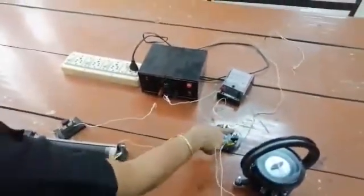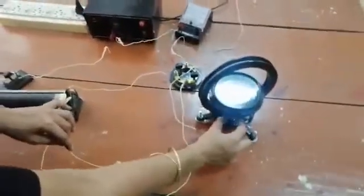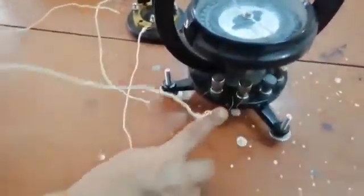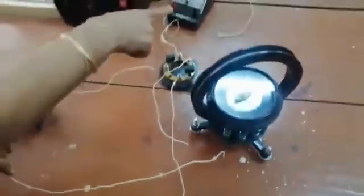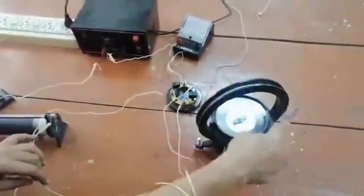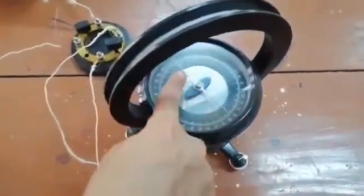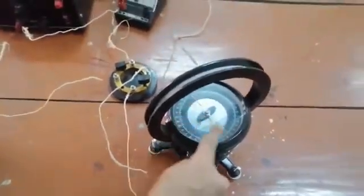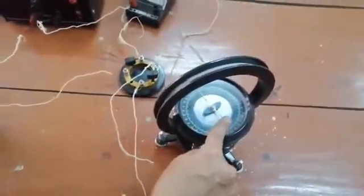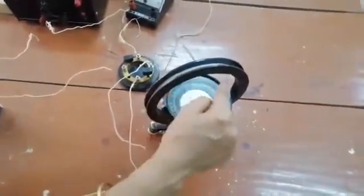For the secondary circuit, the other two ends of the commutator are connected to the first two terminals of the tangent galvanometer. Since the current is flowing through the coil in one direction, we can see that the aluminum pointer is deflected to one side. Earlier it was pointing at 0, 0, and now we see there is deflection in the coil.